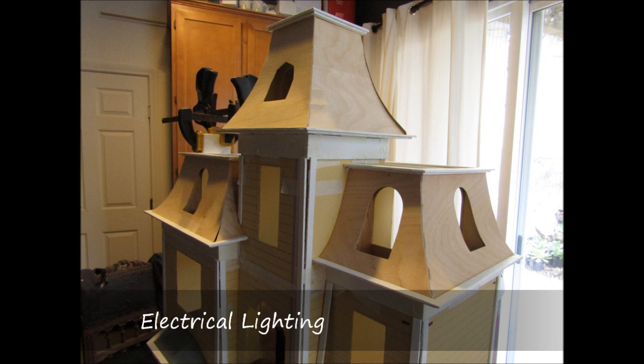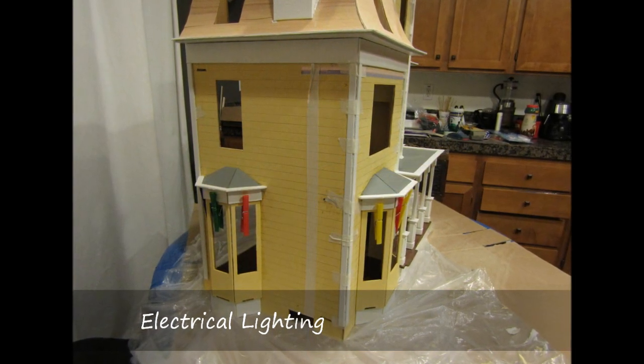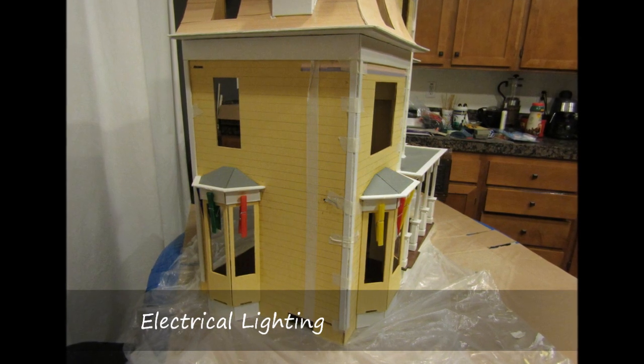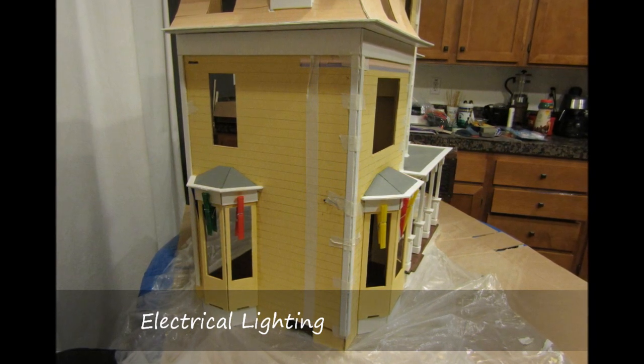With that, tape wire needed to be in the proximity of the fixtures, and the tape had to make a continuous, connected pattern from beginning to end. I used masking tape to play around with the possible layouts of the tape wire, and I wanted the junction box to be located on the underbody of the house where it would connect to the transformer.